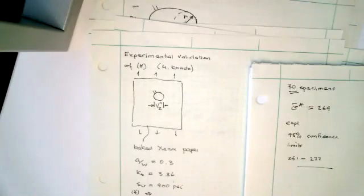Don't ignore it. Now, your microstructure may be different from that of the Xerox paper that Masao used, and you may be able to get something lower. But you want to start off with sigma star equals SU upon KT for a brittle material, until you know that you've got some side effects that are favorable and you can get away with more. That's where you want to start.